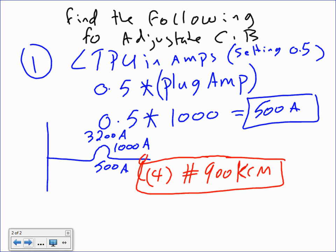the reason why I would do that, guys, by the way, why would I do that? Because this is tied to a 500 amp panel. It's tied to 500. I don't need 3200 amp to feed a 500 amp panel or a chiller. Now, if that's the situation, I pulled 10 runs of 500 based on 3200, and all tied, there's lugs enough for them in the back, and I'm only sizing it to 500. For my coordination, this circuit breaker is a 500 circuit breaker. We don't care about the cables on it.